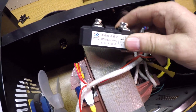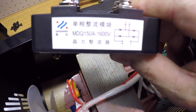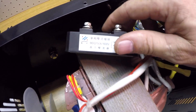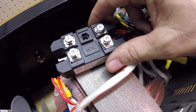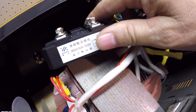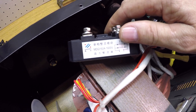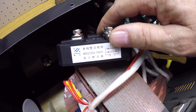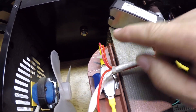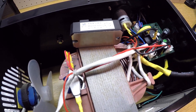For those who haven't seen my first video, this is a 150 amp, 1600 volt bridge rectifier. I think I paid about $10 for this off eBay — shipped. There are varying prices, but $10 to $20. I recommend getting the 150 to 200 amp version; I've seen a couple of people have problems with the 100 amp burning out. That's why I'm doing the heat sink, and I want to mount it where the fan will circulate air over the cooling fins.